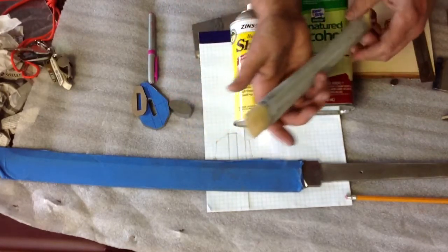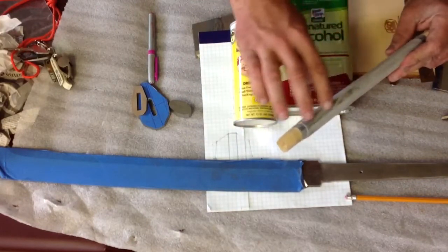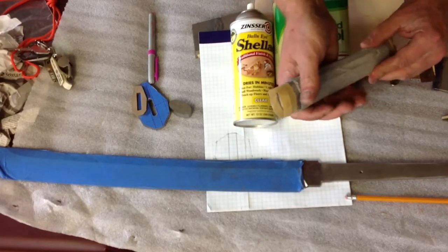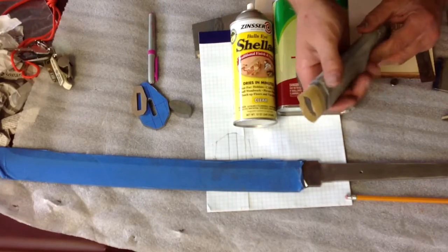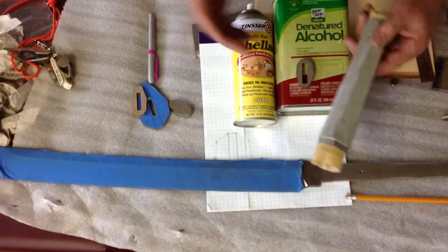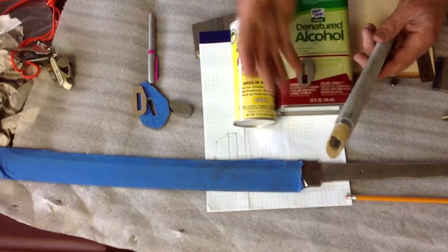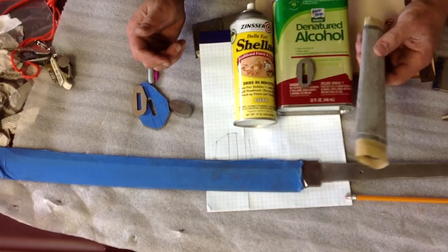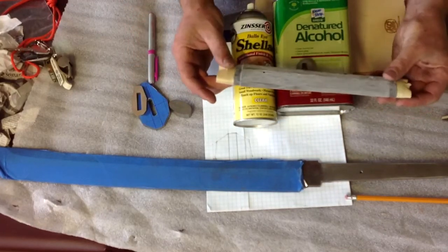It's going to give you a lot of feedback. So basically, this groove right here just lines up perfectly with the edge, and then your hand will achieve the same point every time if you line this in your finger grooves. And that way, when you're cutting, you control your plane by this handle. It's kind of like a rudder for a boat or something. But it works really well in lining up and being accurate when you're doing your cuts.